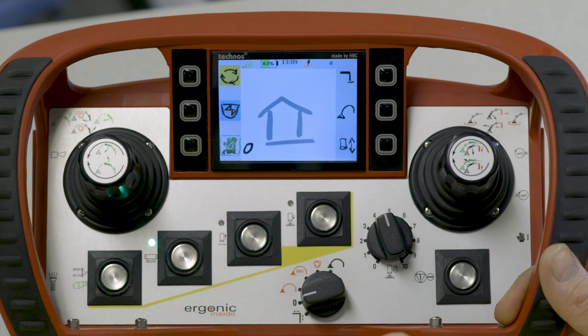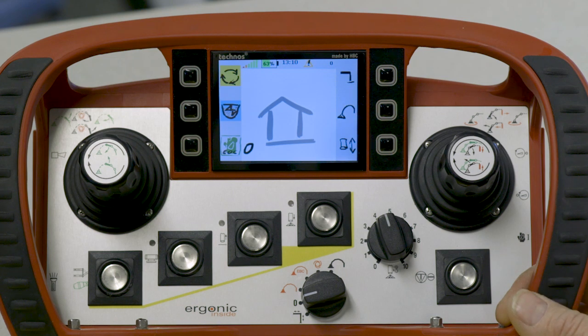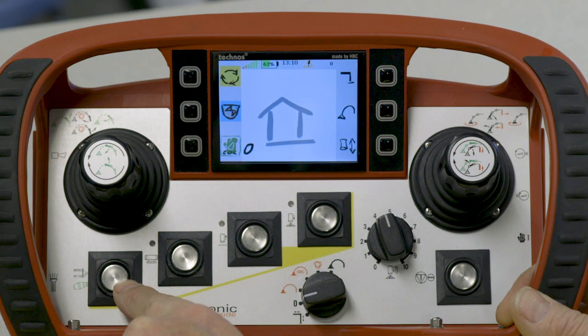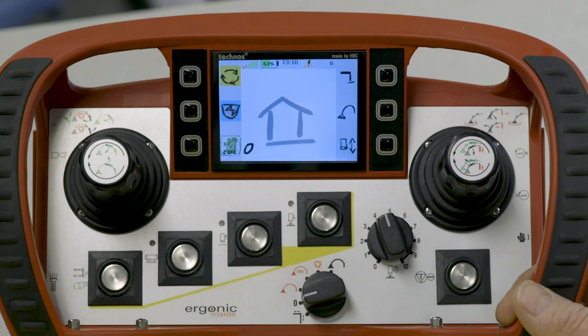So he has the ability to control the vibrator with pump on, pump off, or with the pump not stroking. With the light off, no vibrator activity will happen. All of these buttons have LEDs that light up to indicate they are active. The next button is the disturbance switch or stroke change — some operators call it the struggle button. What this does is disturb the stroke instead of waiting for a proximity switch signal. Operators use this for stroke correcting manually.